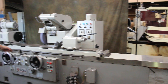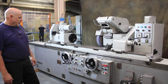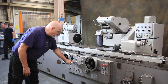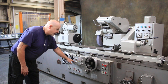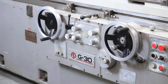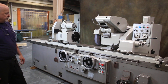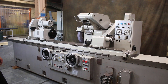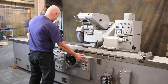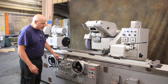At each table reversal we're going to feed. The amount that it feeds you set with these dials, the speed of the table you set here, and if you want any kind of a dwell or tarry, you set it there. That'll just go on like that until it reaches zero and starts to spark out. The hand wheel goes back to where it started from, and I'm going to shut the table off.